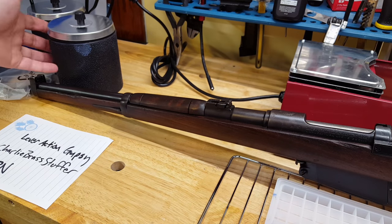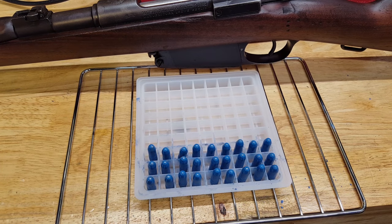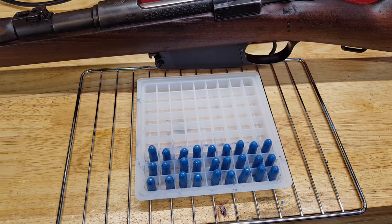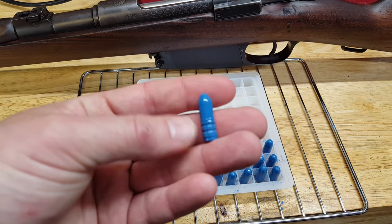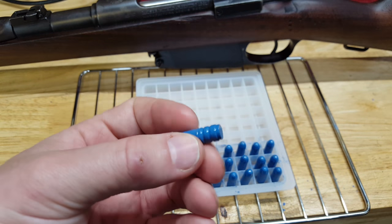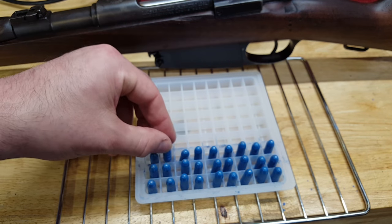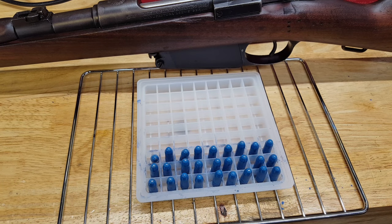The rubber tub does not affect the powder coating at all. I use BBs, so I don't know how great it would do if you didn't use them — I'm assuming it would still do okay. But I really think those BBs help give you a little bit thicker coat, a little bit better coverage. I've tried it without them and I really do think they help, so I'm going to keep using them. I'll give this some more tries and maybe someday it'll replace the wire mesh. Thanks for checking out the video and I will talk to you guys later.